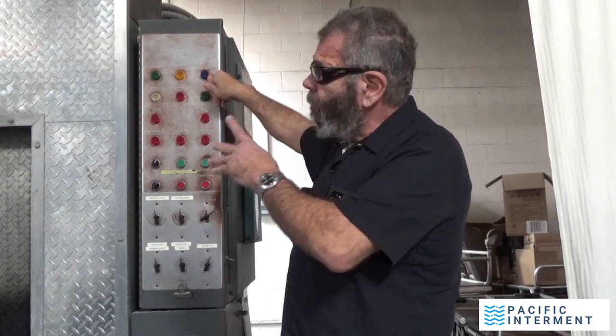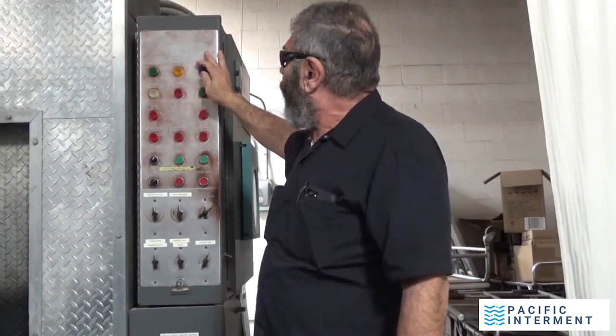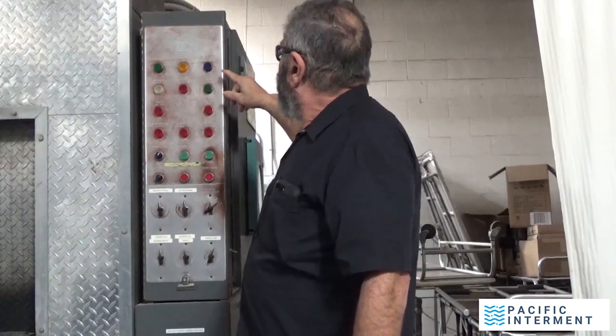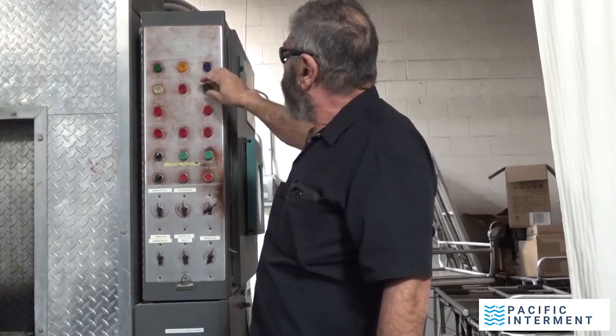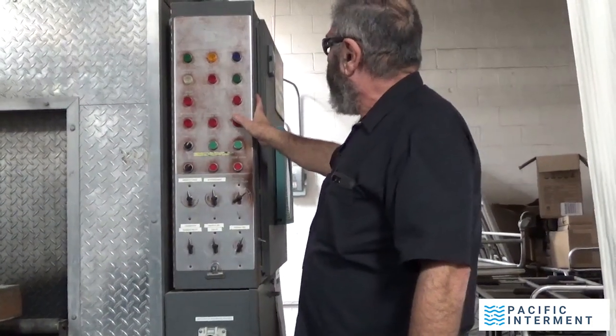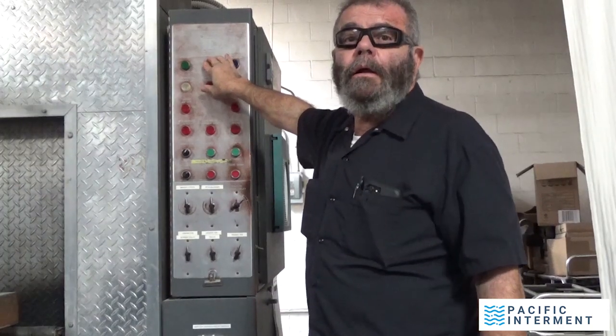This is the ignition burner for the main burner in front for the cremation. So that burner is about 2 feet in and coming from the top. The ignition burner is probably somewhere in the 300,000 or 400,000 BTU, and the cremation burner, which is this light, will kick that same burner up to about 750,000 BTU. This is self-explanatory, door closed. So this light will come on when the door comes all the way down and it's closed. Actually, the switch shows you a door closed light right about here, okay?